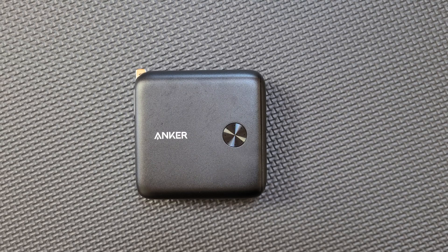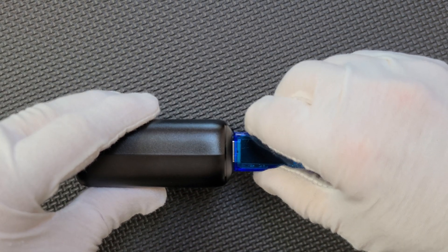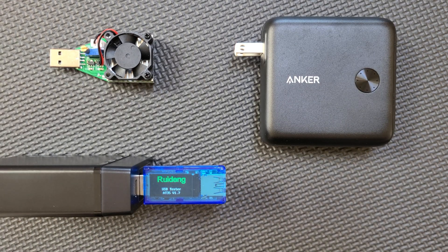So again, major brownie points. But what really matters is the true capacity of the power bank. So let's hook up a discharge meter and we'll come back when the test is complete. The results are in and this device tested 6,276mAh. As I've done on other videos, I want to adjust for the fact that we tested the capacity at the USB output voltage of 5V and the internal cells are rated at 3.7V. So we're going to take the milliwatt-hour rating, divide by 3.7, and that gives us an adjusted capacity of 8,583mAh.